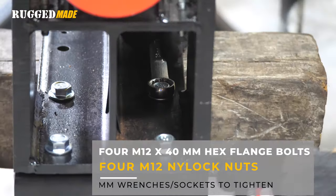There are only a couple of different sizes used on the 300 series. A half inch JIC 37 degree would be for a hose coming up from the pump; three quarter inch NPT is used in other ports; three quarter inch JIC would be used on some return lines. We're going to clamp this valve to the table to get the fittings mounted. Here we've got the Power Beyond port, which comes from the factory with a plug — we're going to remove that, swap it out for the sleeve, and install an elbow. You have to follow this sequence of events correctly. The plug seals with an O-ring so it does not need to be overly tightened.